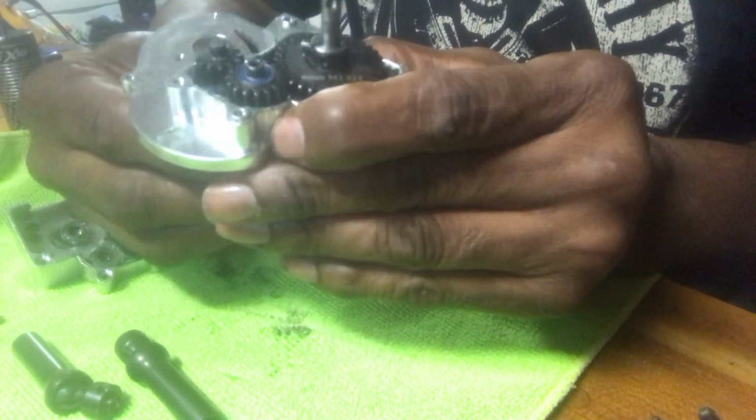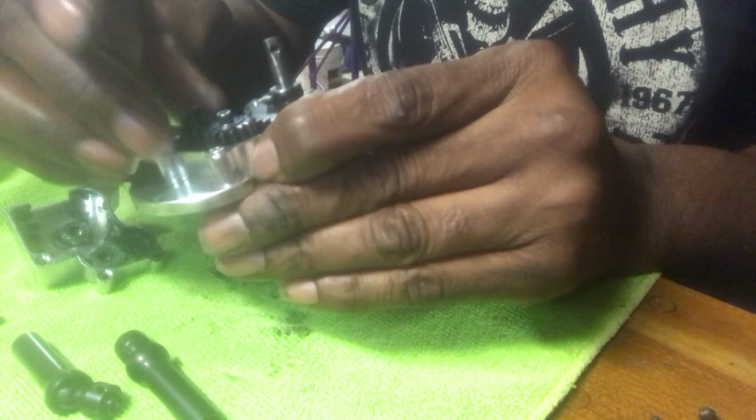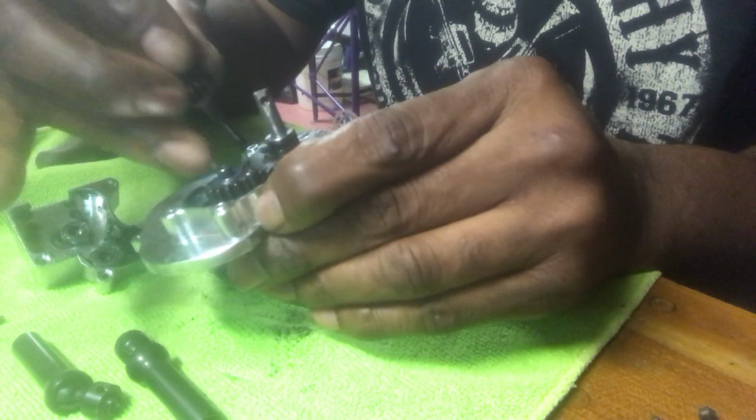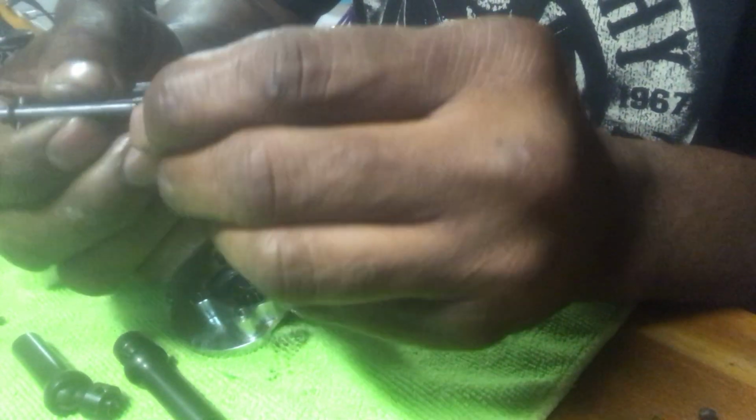All right, the next gear that you've got to modify is your clutch shaft for your clutch. This is probably really easy to do. What I did is I took a 12 tooth Mod 1 gear, and you want to do it just exactly like the other one. I'm going to take it off here a little bit. I want to use my shim up.